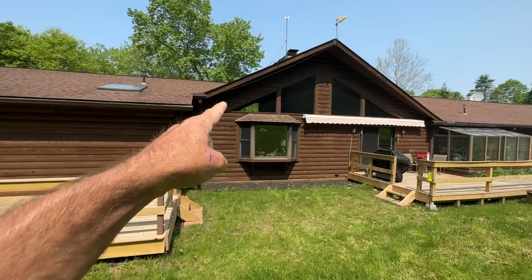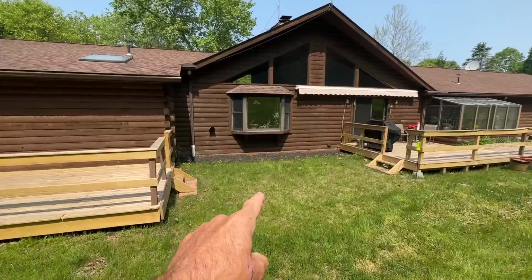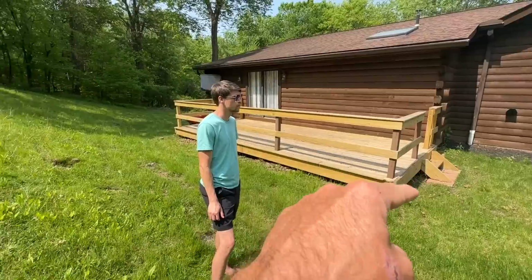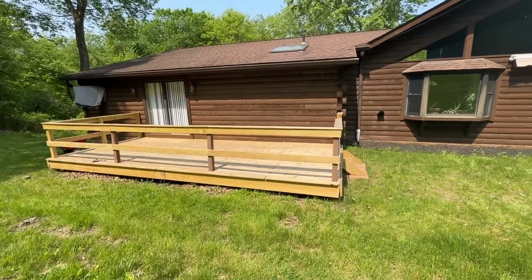We are going to come in off of this slope here, connect into the existing downspout, and reroute that directly into the pond. And then we'll take the excess water from the pond from an overflow. We'll take it around this way where it'll go down grade. So we're on the edge of this hillside here, so everything drops away pretty hard over in that direction.